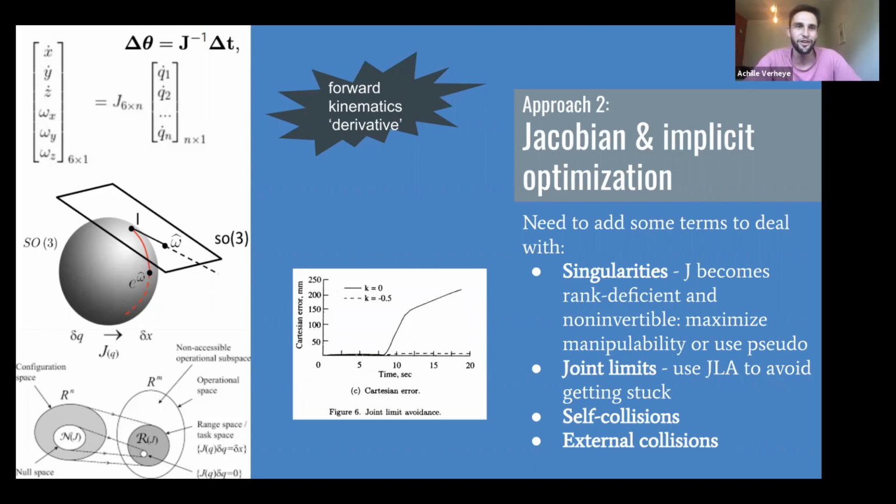And so that works great. At each step you invert some matrix and then apply that, and you get a small incremental motion on your robot arm. So the Jacobian depends on the joint angles at each pose. I invert that matrix, take a step in that direction, and you start following your path. That works great for 6 degree of freedom robots. For fewer or more, you have to make some small adaptations, but it'll still work.